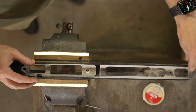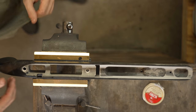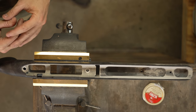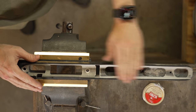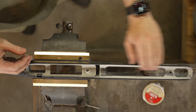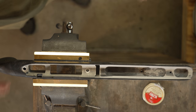Everything should fit as if you were going to go shoot the rifle without bedding it. This one was rubbing on the left-hand side of the barrel channel. I've seen people tape the barrel to make it sit square in the channel — I don't agree with that. It's inducing stress into the system before we even get started. What you need to do is set it in there, torque it down, make sure there is no interference in the barrel channel whatsoever. We'll check it again after bedding and relieve more material if needed.